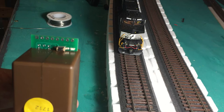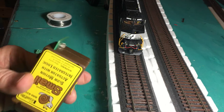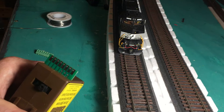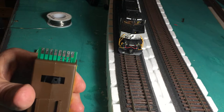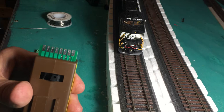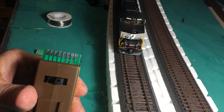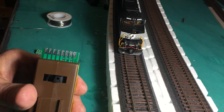The reason that I use these machines rather than the normal tortoise is primarily because of the addressable function. The contacts on the top row are exactly the same as on the tortoise. There are two single pole double throw switches integrated into the circuitry. The two outside contacts on the top are the track power which operates the motor, and that allows you, whenever the track power is on, to address the circuitry and throw the switch whichever way you want it to go.